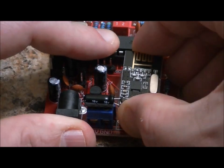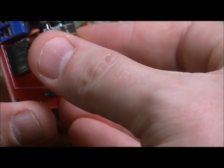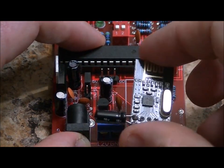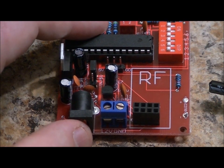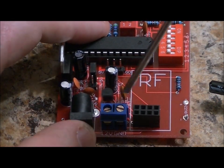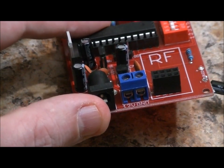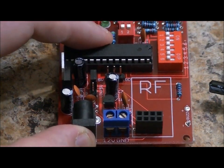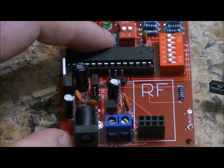The NRF24L01 Plus can be removed and placed back in. If you are placing it in for the first time, make sure it is lined up perfectly. I've added a capacitor here — there's capacitance on the 3-volt line on the board, but these modules act better if the capacitor is right on those leads. There's also a screw terminal block that allows you to wire in your own power connections if you wish — you don't have to use the power jack. Just unscrew it, put your wires in, and tighten it. The two pins are labeled 12 volts on the left and GND on the right. It doesn't have to be 12 volts — 9 volts is actually preferred, but 12 volts is fine. It comes with a 9-volt power adapter if you've pledged towards a reward tier that includes power adapters.